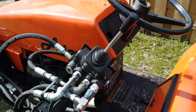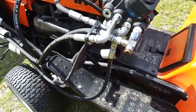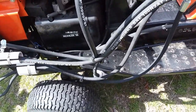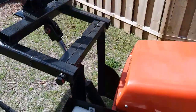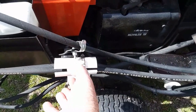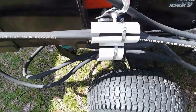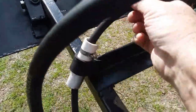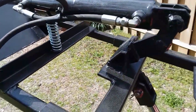Here you can see the spool valve. This is a four-position with a single joystick. My supply line comes in, my return goes to the tank, and my lines go out to supply the cylinders. I find that using PVC makes for a nice, closeable — using a clamp — and mountable holder for the hydraulic lines. You can see it down there as well, and up here. This can actually slide a little bit as needed, also giving support up there close to the cylinder.